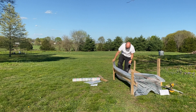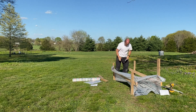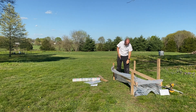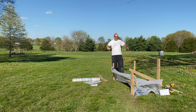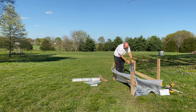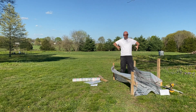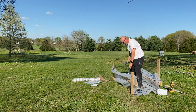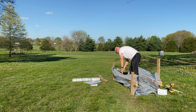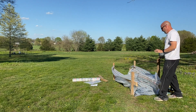What's happening is even if your ground isn't level or the dig isn't perfect, you're keeping the line that gives you a 24-inch wide footer. It'll bulge out in the middle, which is actually good — that curve makes your footer stronger and less likely to crack, which is better than a simple square or rectangular form. When you staple it every four to six inches it'll hold a ton of pressure. That's the gist of it.